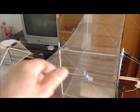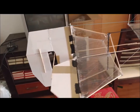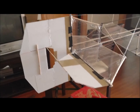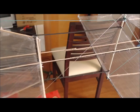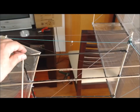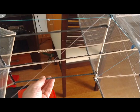The structure has been further stiffened, triangulating almost all of it using the fishing line. To solve the tail lateral buckling problem, we have placed two carbon fiber strips arranged horizontally, so that the greatest moment of inertia of the section coincides with the lateral buckling plane. This way, we form a kind of H-beam that has torsional stiffness and stiffness in two planes of flexion. The stabilizers have been linked by wooden sticks, so they move together.